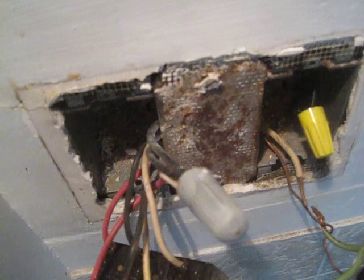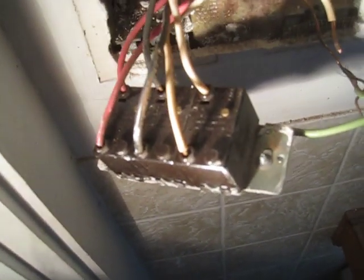So anyway, I'm going to remove the plate, remove the three-function one-yoke switch, move the white over to neutral, move the ground to ground, and eliminate the heater function of this three-function ceiling fixture.